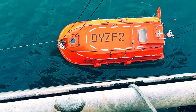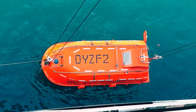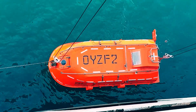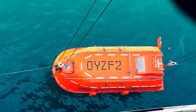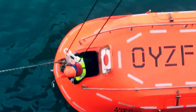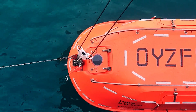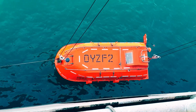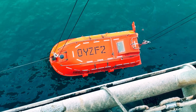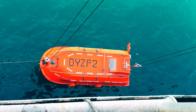Once both blocks are inside the hooks, the boat is quickly heaved up just above the water to check that everything is okay. Both hatches are opened to verify the hooks are reset properly. The FPD is put back in place — this is important both during launching and recovery. Check that both hooks are in the green zone, the lever from the coxswain position is in its normal closed position, and the safety pin is in place. Once confirmed, we are ready to be heaved up.